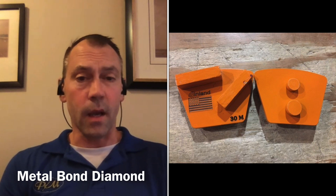Which is a segue into the next question: define a metal bond. With that being said, would you say a metal bond is exclusively for prep? Yes. It could also be used for honing, which would be a portion of a polishing process where we're trying to refine the surface of the concrete to have less noticeable scratches. So there could be a metal bond being used to strip an epoxy coating, and there also could be a metal bond tool being used to close up a scratch pattern before the resin bond were to take over.